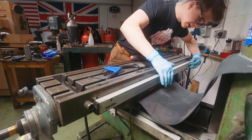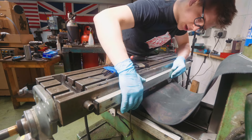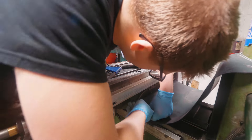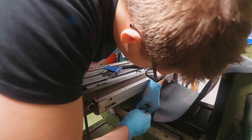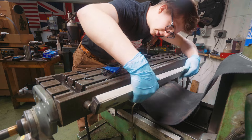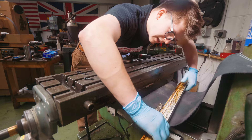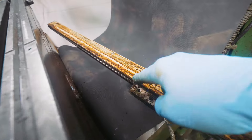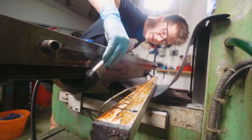What I've now done is I have unscrewed all the mounting bolts for the DRO scale here at the back, and we should now be able to lift it off. I made a stupid mistake though — I forgot to remove the little bracket that holds the wire, and I dropped my Allen key. So I'm going to unscrew this. And this DRO scale should lift clean. Look at how nice and messy and ugly that is. Let's go ahead and clean this — there are chips in there, so I'm going to take some acetone and give it a thorough clean. There is some serious gunk buildup.